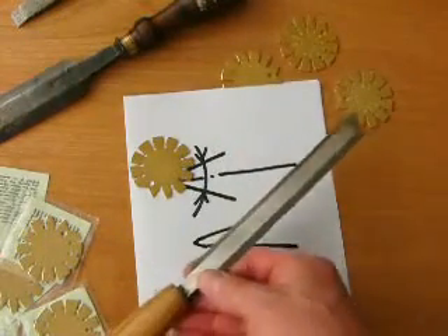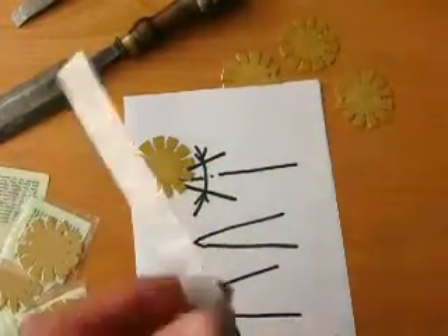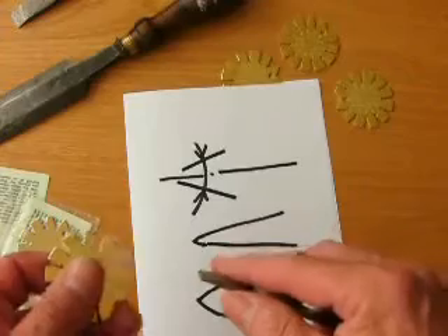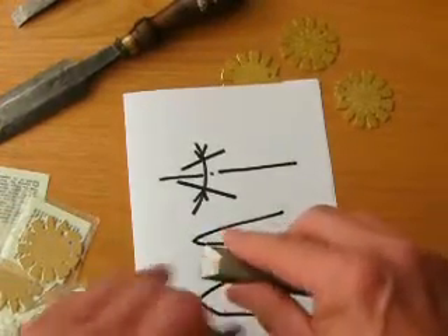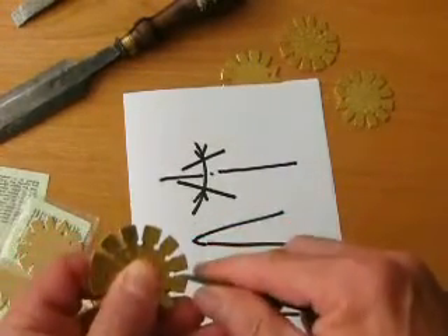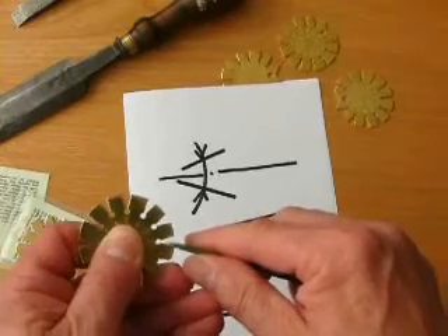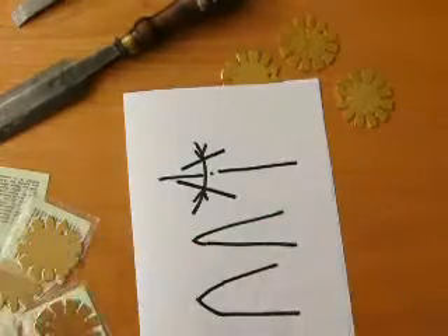Here's a rare beast — that's a Henry Russell. There are very few of those knocking around. It's a nicely balanced tool as well; it's got a thrust washer in. That's dead easy. And using the bevel gauge, it's interesting to find out how obtuse I've been honing the angles. Grinding is the preparatory rough process; honing is our little finishing process. So again, right angles to the thing — perpendicular. Achieve our datum, and then push it up against the angled face. What you're doing is moving it from one to the other, checking for light until you think it's appropriate.